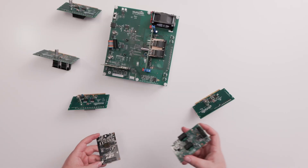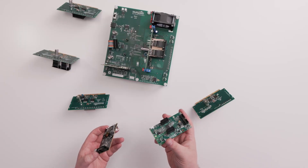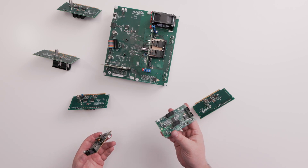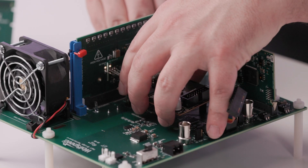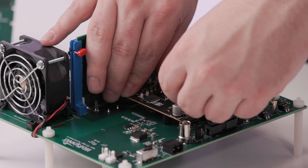This can save you weeks of work. Normally to change out a gate driver you would have to re-spin your board, which could be one to multiple weeks of work and manufacturing. I can change them out in just minutes. The new card populates down onto the headers in front of the power device daughter card and the ribbon cable attaches for the gate drive signal.